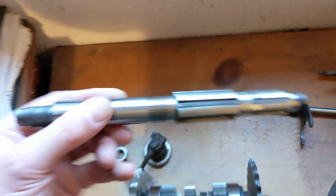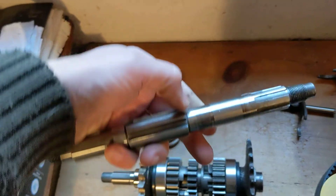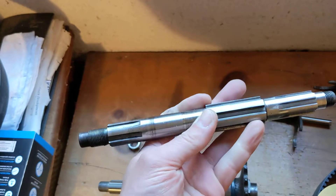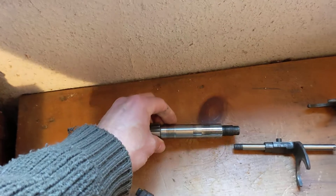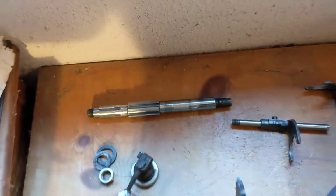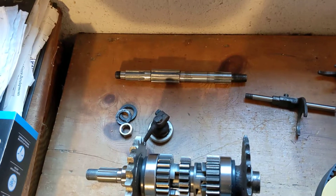If not, we'll have to make our own main shaft. We did think about taking a pair of these and cutting them in half and joining them together - either with a press fit sleeve or getting them electron beam welded together. But I think if we can make it from a single piece of the right hardness, because gearboxes need to be quite hard, that would be much better.